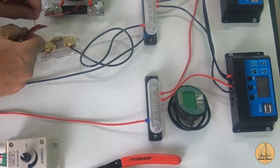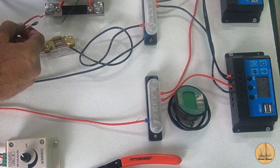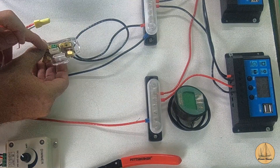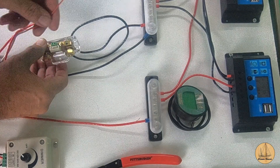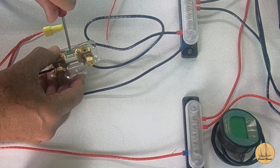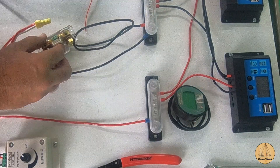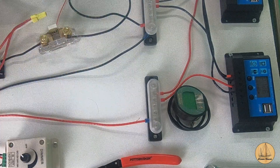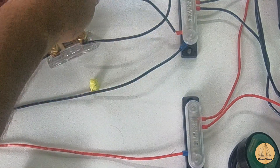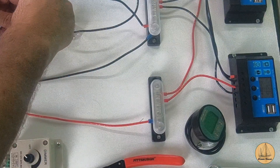I'm putting the flat washer on, then the lock washer, then the nut — doing the same on the load side. I have a terminal strip set up for the overall negative load. I'm removing my old battery monitoring power cable and getting the old shunt out of the way. I have a small wiring pin that goes into one of the B-plus terminals. I'm connecting up the little monitor — it is turning on. I've tightened both negative cables on the shunt, and it's just a matter of reading the instructions as a first step.